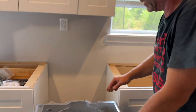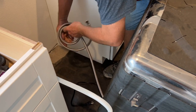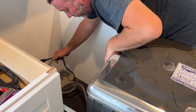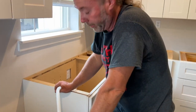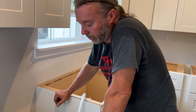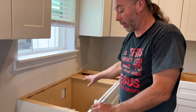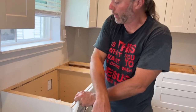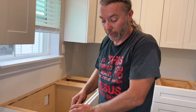We take the hose and drill a hole through this cabinet, which we haven't done yet. This gets plugged into this outlet - pretty simple. And then this is our drain. On the drain, it's important that you go up high with the drain because you don't want water sitting in the belly - stinky water. So we drill a hole up high, it comes down, and then it goes into the side of the garbage disposal. When this drains, it drains into the garbage disposal - you can turn that on, run stuff, get it all out, and then it drains from there. Water coming in from the shutoff valve, power, and then drain - that's it.